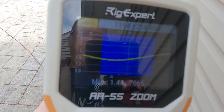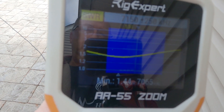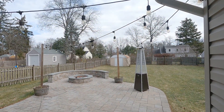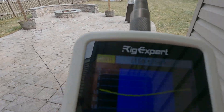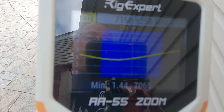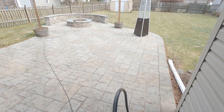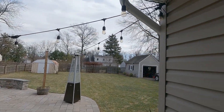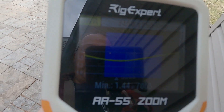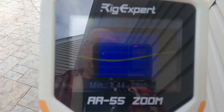There's our kind of final result. I wound up shortening the wire once and twice, and I also experimented with putting a common mode choke 0.05 wavelengths down from the feed point up there. I found that I actually had better results without the common mode choke. Part of that might be due to the fact that this antenna is pretty low to the ground — only about six or seven feet up at the feed point, about 25 feet up at the temporary mast location. But overall, pretty good, and I think this will be usable for field operations.